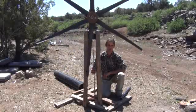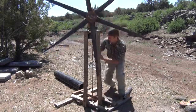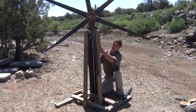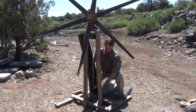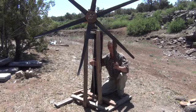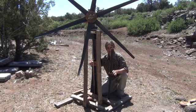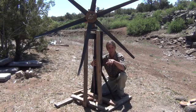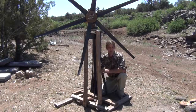I'm going to let that slow down and show you a couple other little quick pieces of it. Off the bottom of the shaft here, or the main stabilizer that lets it rotate, what I have here is going to be a piece of black corrugated septic pipe or water drainage pipe. It's actually going to connect up inside of here, right to the bottom of this black paint can that's coming through here and out through the bottom of the pump housing on the wood. This is going to sit there and allow it to spin with the pump housing inside of it — my pump case. That's going to allow the pump case to actually rotate inside of this to pick up water instead of having it try to rotate dead still. I had a problem trying to find pieces to make a single pivot point that would allow a shaft to go through right there, so I had to create something a little larger and I'll show you it up close.